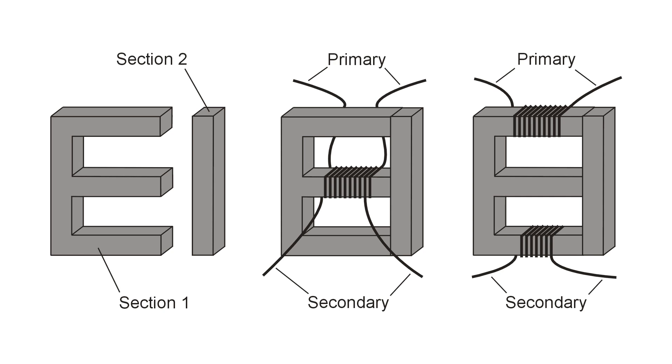Stan Jebalisko here. I'm going to show you two different ways to wind an AC transformer core with the primary and the secondary coils. This particular type of core is usually called an E-core because it looks like a capital letter E, and then it has a bar that clamps on and forms what might better be called a theta core because it looks like the uppercase Greek letter theta — but people probably wouldn't know what that meant.